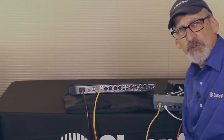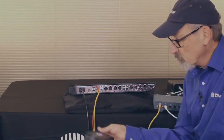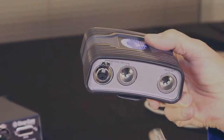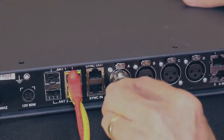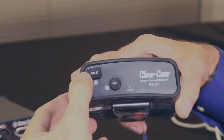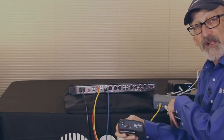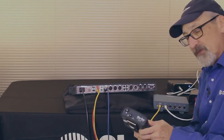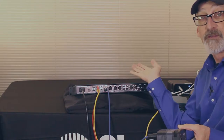Let's talk about a basic connection to a two-wire device — let's say a two-wire belt pack like this ClearCom RS701. I can connect to it and plug into the back of the base station, let's say into two-wire port number A. From the front panel I can configure it to have power and termination. And as you can see, the belt pack lights up and it's fully functional now. Once I've set it up in the software or from the front panel, this belt pack or a two-wire system that would connect here is part of the system.